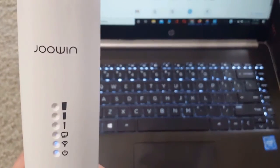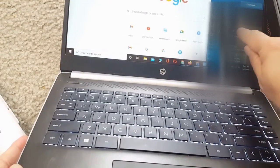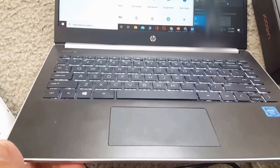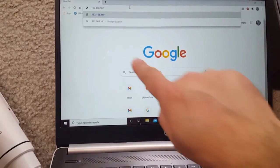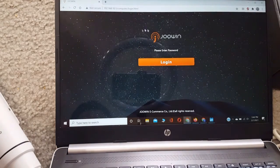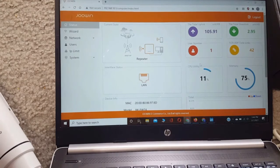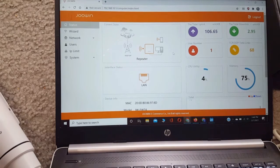Through the laptop you'll also see the computer-connected blue LED. Connect your laptop to the device's Wi-Fi — the SSID usually starts with 'JW'. Once connected, open a browser and go to 192.168.10.1. The default password is 'admin'. Once logged in, you'll see the admin panel, including processor usage and storage stats.